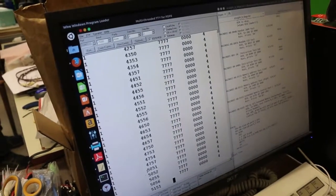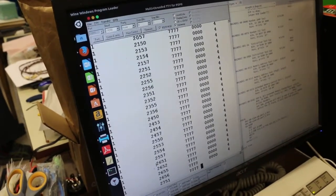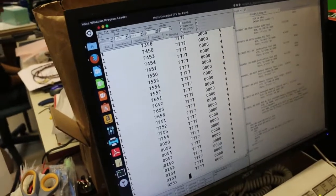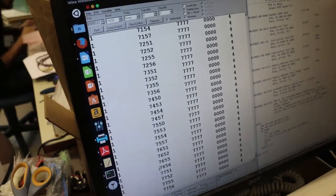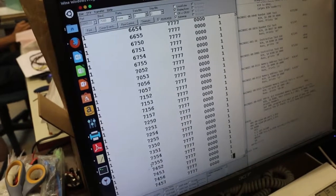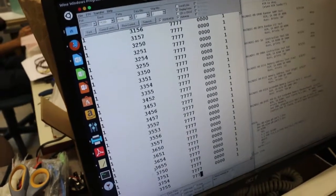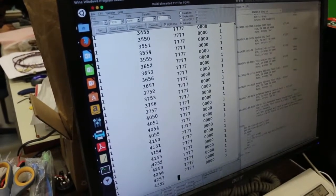Now we're on to test four. When the display stops, that's because we're passing — it isn't always failing, which is itself interesting. Each X or Y select line selects 64 locations, so if you lose a select line you'll get groups of 64. It looks like we've got a few more than that. Going to zeros would imply the inhibit line isn't working, but that usually happens on a single bit — so at first look this is a little confusing.